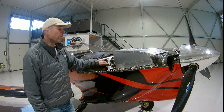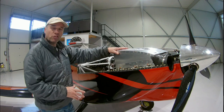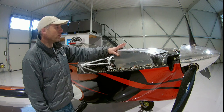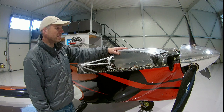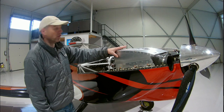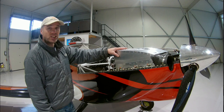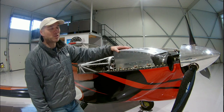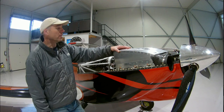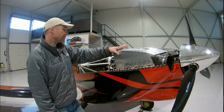The engine — I've got the top cowl removed. This is the UL Power 520 ISA. The A stands for aerobatic, meaning it has an inverted oil system. It also has a flop tube in the left tank, which allows sustained inverted flight. The S in ISA stands for high compression, and it needs at least 97 octane. You can put MoGas in there — we have Euro 98 in the Netherlands. It has 5% ethanol, but there are stations that create special blends of 98 without ethanol, mostly for performance cars, because ethanol's hygroscopic characteristics can cause corrosion.